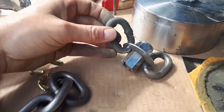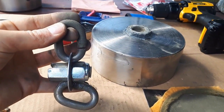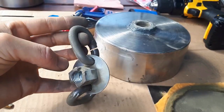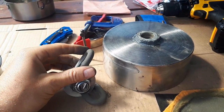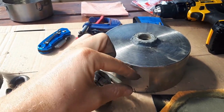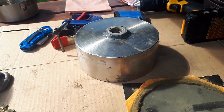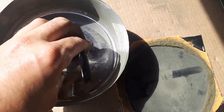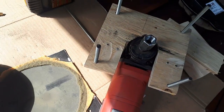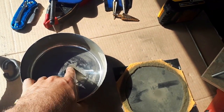You can even rotate the chain links if you want — if the side taking the beating is wearing down fast and the other side is good, you can flip it around to get maximum life out of your chain. The key design feature is freedom of movement: when the chain link hits a rock it can bend backwards so the rock can pass by without getting jammed between the chain link and the wall. Make sure you manually crush any rocks that are too big to pass through the gap, because you'll end up with a rock jam that can ruin your motor.